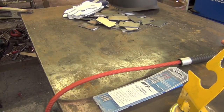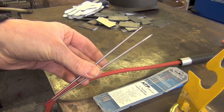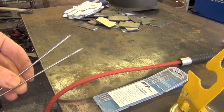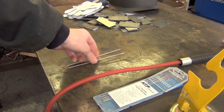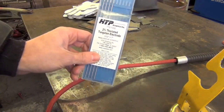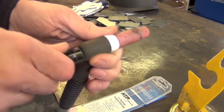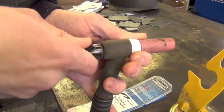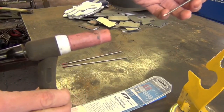You may be wondering how to swap out a tungsten electrode. I've got these two freshly sharpened electrodes fresh off the bench grinder, and I know some people talk down bench grinders, but I got all of my TIG certifications running HTP tungstens sharpened on my school's bench grinder and it turned out all right. Basically, you're going to give this back cap a nice twist — lefty loosey — and ideally you should just be able to pull the tungsten out like that.